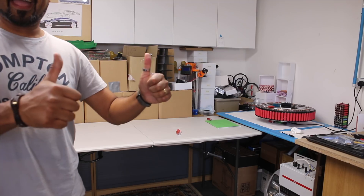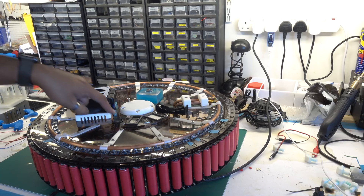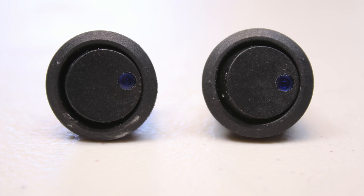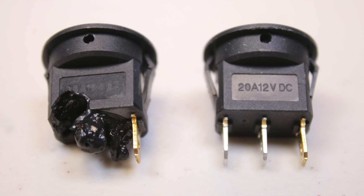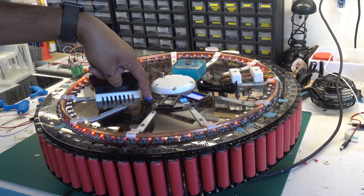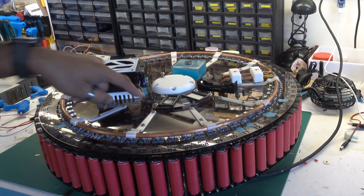To say things progressed without issues would have been an understatement, but it's why we do these projects — so I can make the mistakes to learn the lessons. One of the first items that caused an issue was a small toggle switch which I used to isolate the charging current, and again this was seriously underrated. I found a 100 amp relay switch was much more suitable. The toggle switch now provides the 12 volt power to activate the relay that then supplies the current required to start the charge.